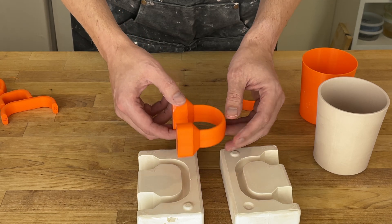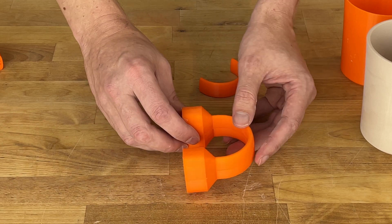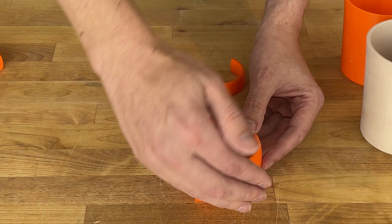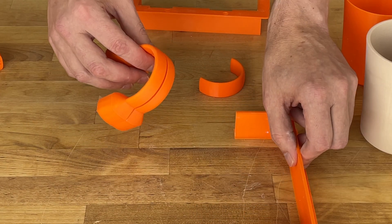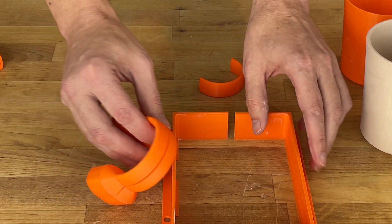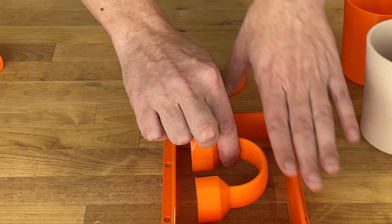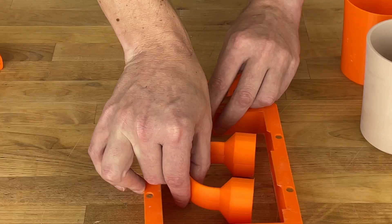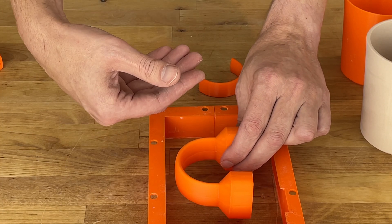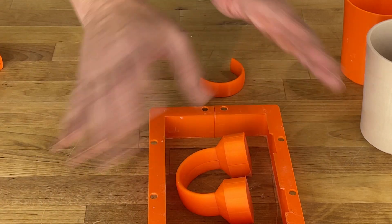We want something similar for this. Doing it the traditional way, you can carve this — make sure there are no undercuts so it doesn't get stuck. Then you'd build walls around it and put clay in the bottom up to the halfway mark. You'd have the handle embedded to the midpoint line in clay, then fill the rest with plaster. Once the plaster cures, you take it apart, flip it over — plaster on the bottom, clay on top — remove all the clay, and fill it the rest of the way with plaster. Between those layers you'd put mold soap so the plaster doesn't stick to itself, and then you'd have the two parts.